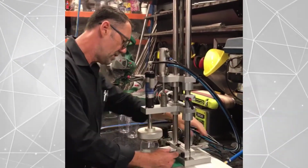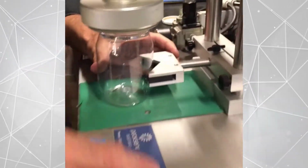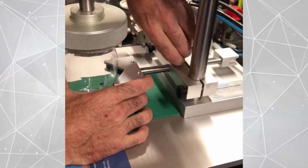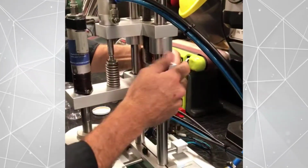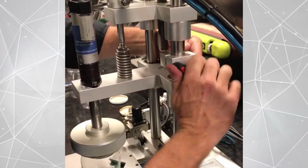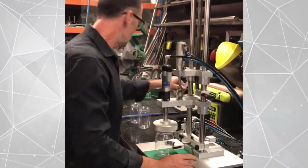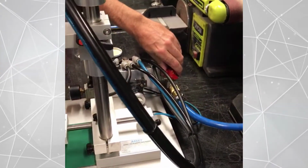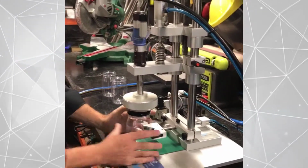While we're here, we'll get the trigger, we'll pull this out, pull that onto the container so it's in the initiated position, and then we'll lock this off. This is the upper stop position. We'll bring that down, we'll give that about 10 to 15 millimeters. That should give us the clearance to get the bottle in and out without catching. Get some air on. That's good clearance for the container.